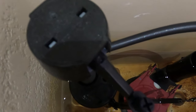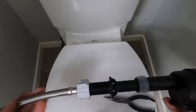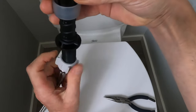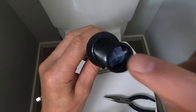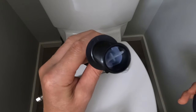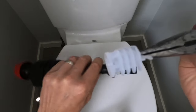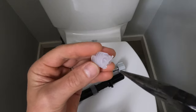If it's still hissing, then before you go to change this fill valve out there is one more thing you can check. Here's a new fill valve with your water line attached. If you turn the water off to the toilet and undo this — you would undo your water line from the fill valve down at the base of the tank. Now I'm going to flip this over. In some of these there is a water restrictor in there. It basically slows the flow of the water going into the tank. If you take a pair of needle nose pliers — you would be going from underneath like this — you pull on that: there's the flow restrictor. The water hits that and it goes through some channels along there, and it just slows that flow down.